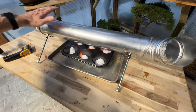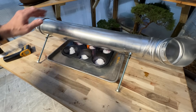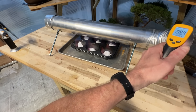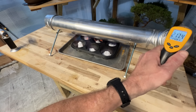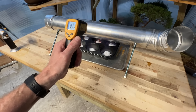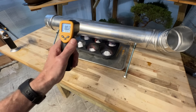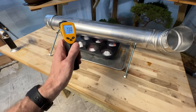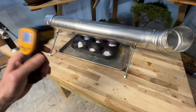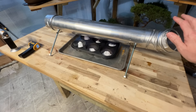We'll do a little test to see how hot this gets and see some air circulating out of our little homemade stove. I can feel air quickly exiting from the right side of our homemade heater. It looks like it's coming out at about a little bit over 200 degrees at the center of the pipe — about the same temperature on both sides. The intake side is quite cool — 72, 71 degrees, room temperature air. But as it makes its way through the pipe it gets quite hot, then it exits out and you can direct it.